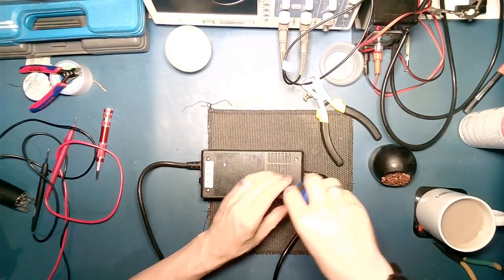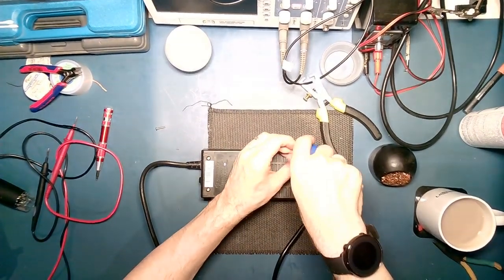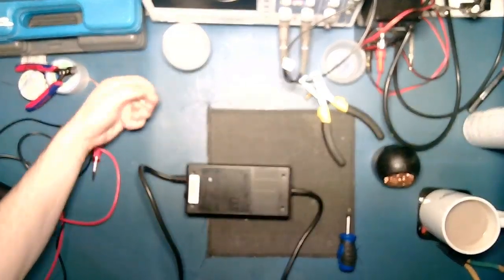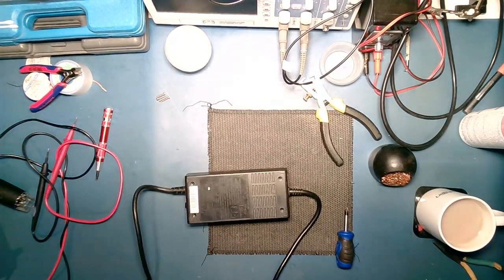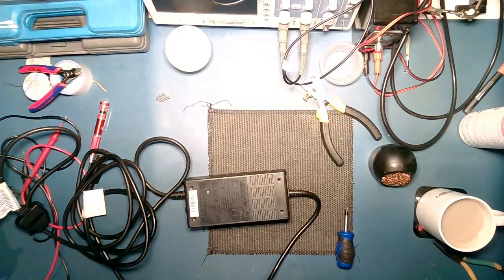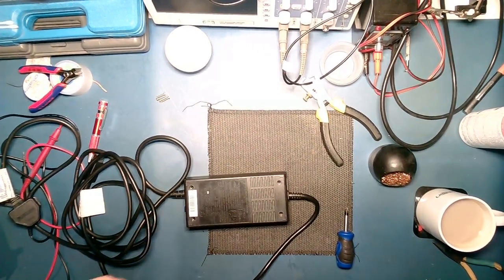So this is one of the 25-watt supplies. What I'm going to do, because I haven't got this in the books already, is actually write down what caps are in this, because the way a lot of the stuff I do works is we've got databases of all the stuff we repair, and in said database is a list of all the parts for each of the different types of machine. There's so many different variants, it's not funny. You know, even in like the A1200 and the A600 ranges.